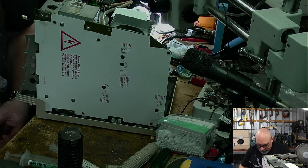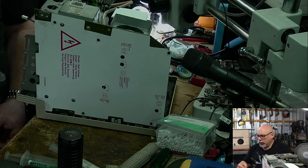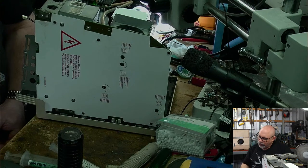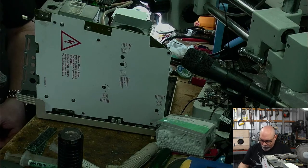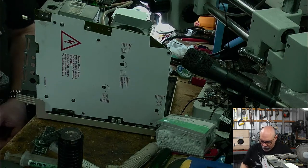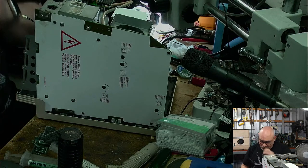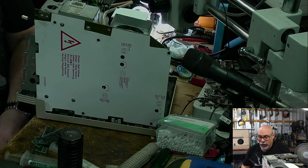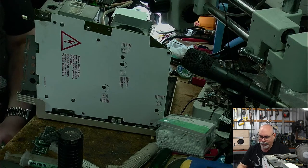I hate these. Okay, so I'd love to know what these RAM SIMMs are, because they're Southland Microsystems. They're coming out. I'm just going to try these four. What are these ones? These are 50. These are fast. 50 nanosecond. Normally on these ones you'd see like an 80 or something. I'm going to put some slower ones in just for testing. So out comes the RAM.